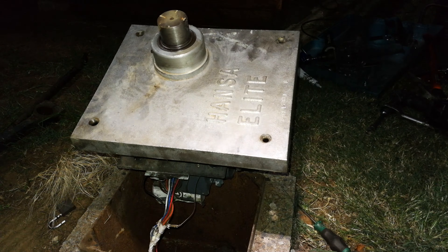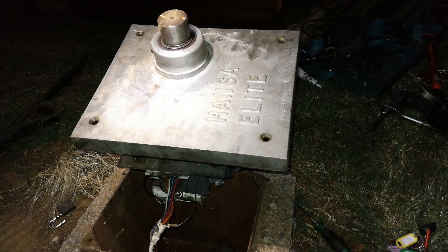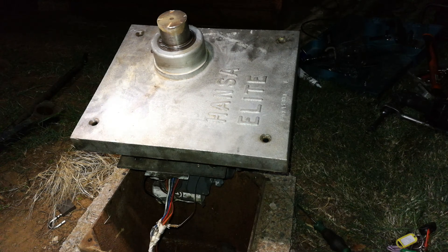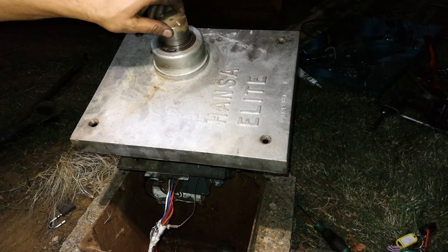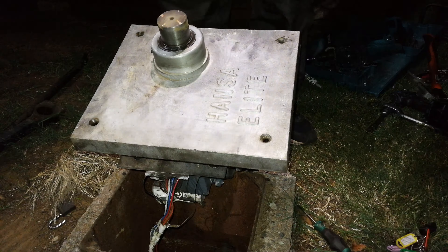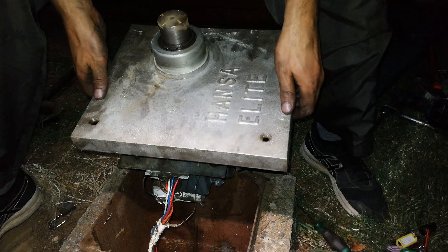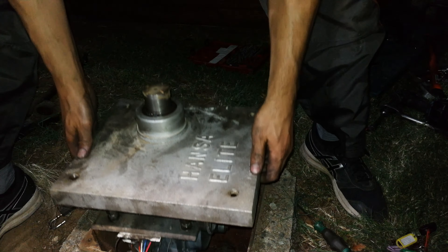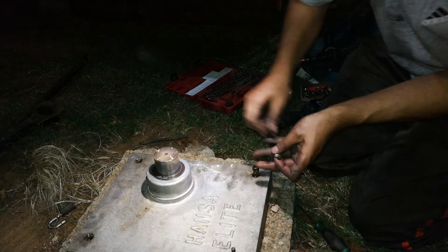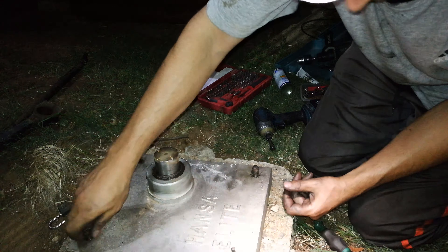Now I'm going to open it — let's see if it closes by itself. That's it. Now I'm going to connect up the arm and connect it to the gate. Be careful when putting this in that you don't get any wires caught. Best to first thread these bolts by hand just in case you cross-thread them, especially if you use an impact screwdriver.